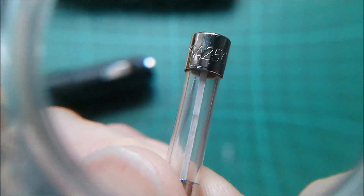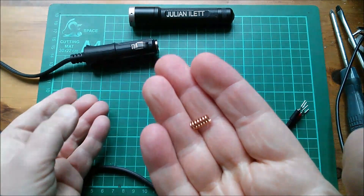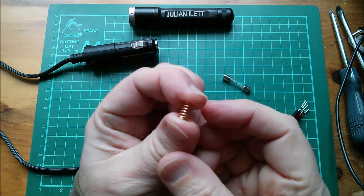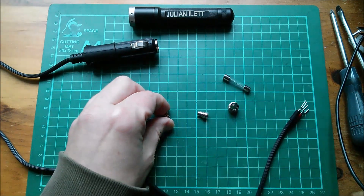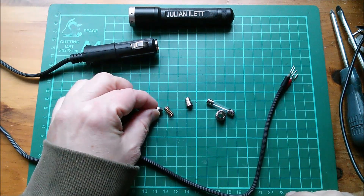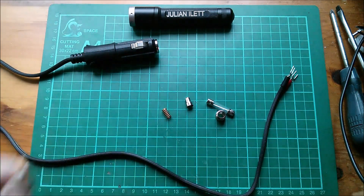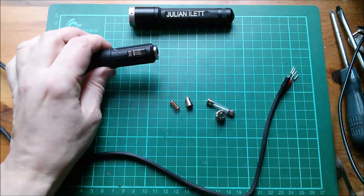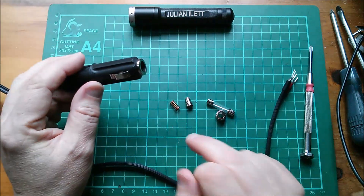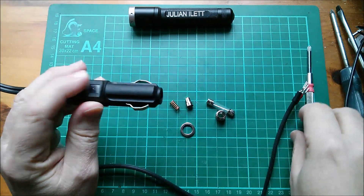The next thing is the spring. It's copper-colored, but is it pure copper? Can you make a spring out of pure copper? Let's test it with a magnet — and as you can see, no attraction at all. So this is either pure copper, brass, or something similar. It's certainly better than those flimsy, thin, lightweight steel springs you get in the cheap plugs that melt at 10 amps.